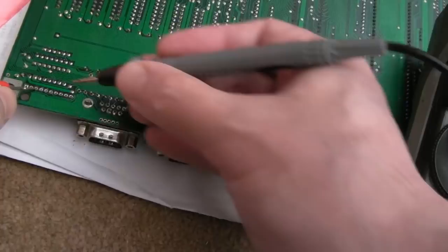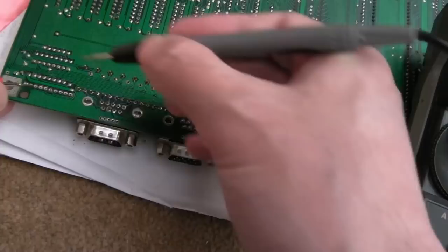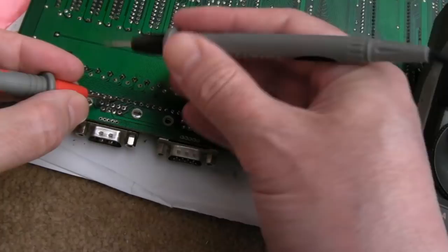So this is in relation to the fault with the left, I think it was. I think we had left and right, didn't we, alternate between these. One of them is right, one of them it was left. But anyway, it's the third pin there, that's the one on this port. There was a problem. So it goes to the pin that's questionable. It's got a questionable resistance there, which could indicate these components here. Now, if I just measure, let's do that one. It's a dead short. So those are supposed to be a dead short.